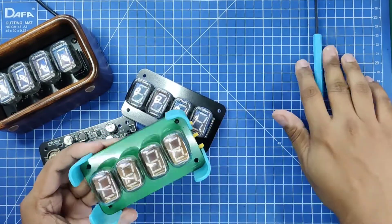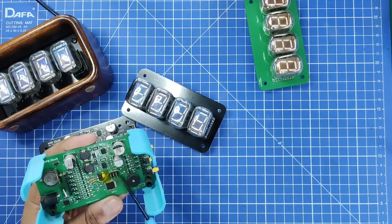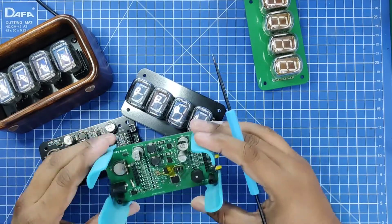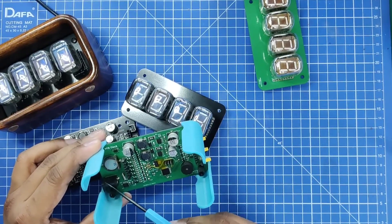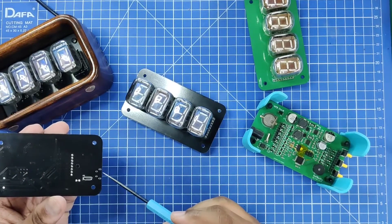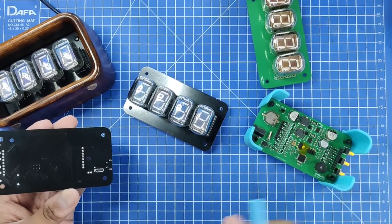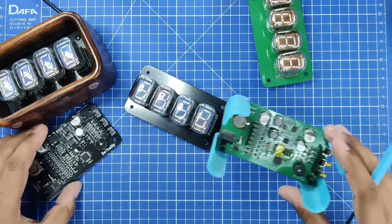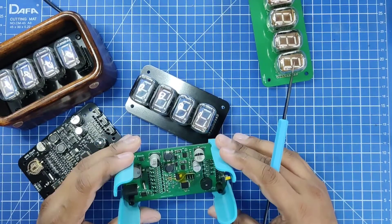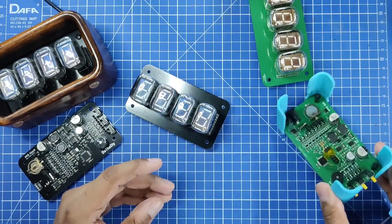This was the early prototype, which had some bodge wires to make it work fully. The initial prototype was designed to work on a DC jack from 5 to 12 volts, but the later PCB is designed to work on micro USB. I kept two slots to populate depending on the enclosure. When the RTC battery is populated, this is how it looks.